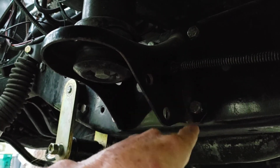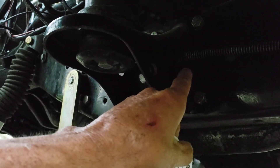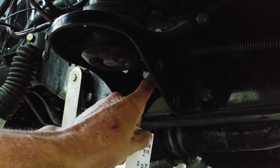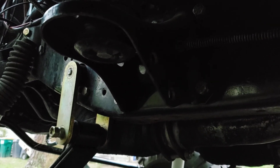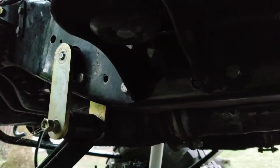I had a long eighth-inch drill bit. I measured up to where I wanted it to be, drilled the hole, and then transferred that hole through to the other side so they'd be in line with each other. The eighth-inch bit is about a ten-inch long drill bit, so it kept everything in line. It works.